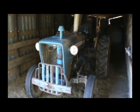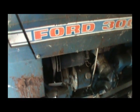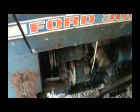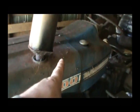Now talking about generators — got a bunch of kitties and one up in the seat. But this is a '74 Ford 3000. It does have the generator on it, which means it has to have a voltage regulator, which is this unit right here — and this unit sits right up in this area.